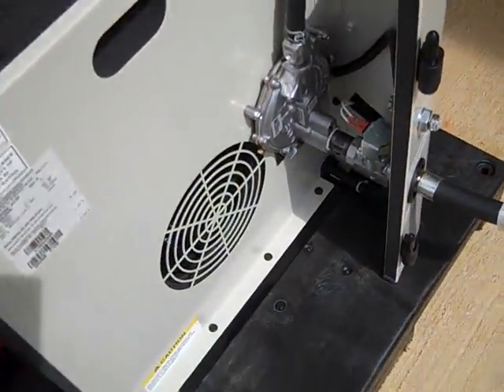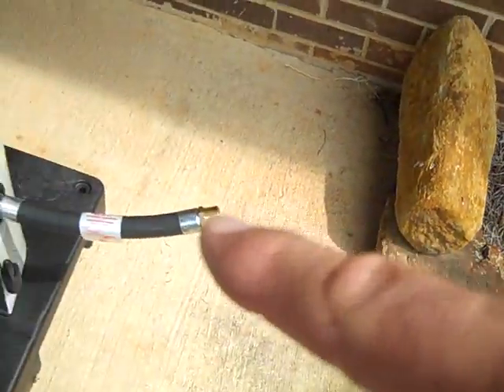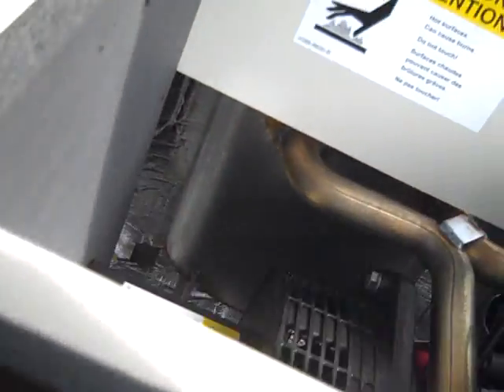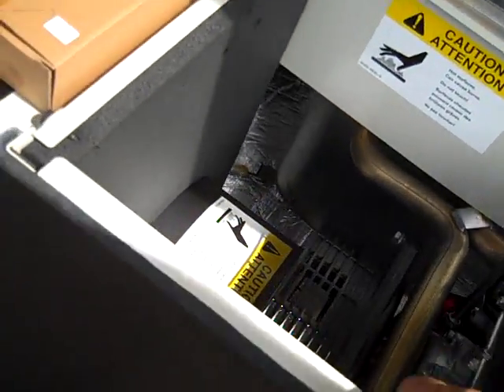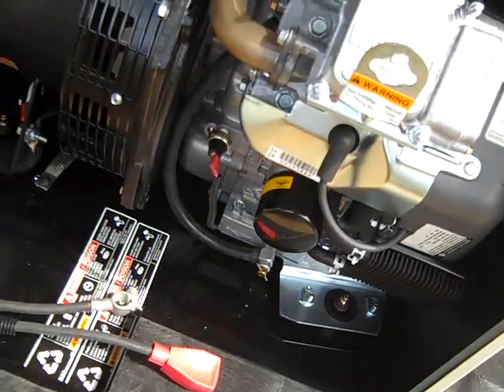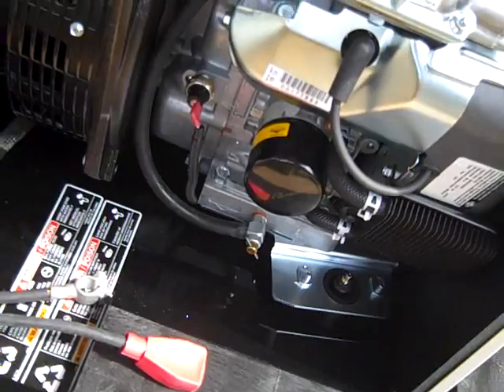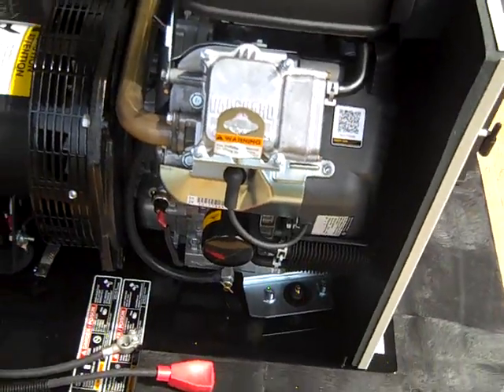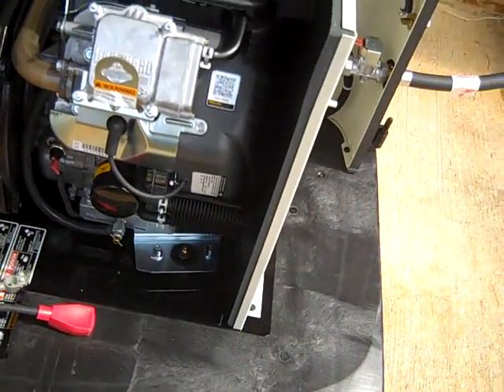Very quiet regulator on this side. We're probably going to mount the regulator to the house on this job, run it over here and then mount a 200 amp transfer switch next to the meter base. It comes with the controls in these boxes here — we'll show you later on when we go to program it. The covers just pop right off so it's easy to get at everything for servicing. External spin-on oil filter, great setup. Nice motor mounts.